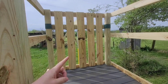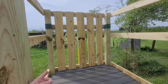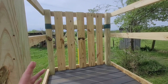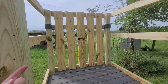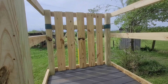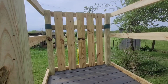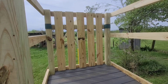At the end of day two we're about six working hours in. For fun, we installed the swings — just putting the bolt up and through and tightening from the top — so we can have a little fun while continuing to build. Now it's time to install the safety walls across. These are just deck boards and 48 inches tall. There were no directions on spacing, so I did the math and a two-inch space between each board was perfect. Not all walls will be 48 inches tall. Make sure you measure top to bottom as you go. I'm going to make some different openings than the directions for things I plan to add later.